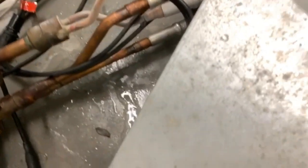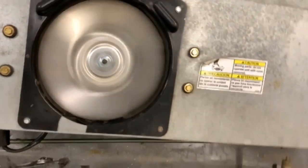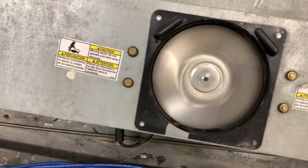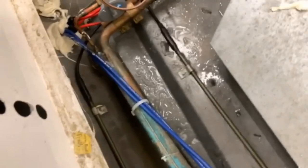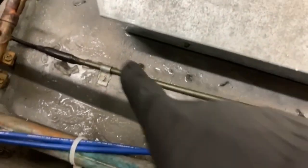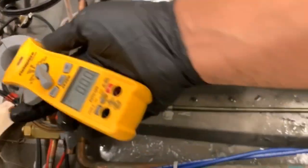FYI — these are tub cases, open air. The fans always stay on in defrost — they never turn off like reach-in frozen foods. They always stay on in defrost. So for any new guys watching, that's what's going on with these. If you want to test them out, you can touch the heater, put some water on there and watch it sizzle up. It's really very low amperage. But it is getting hot — we are pulling amps.